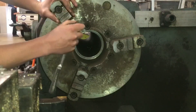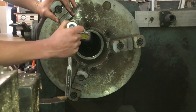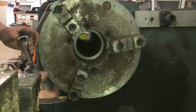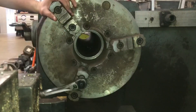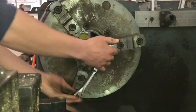I don't think they carry these Allen cap screws at your local Home Depot or Lowe's — they might, but I haven't seen them. So I'll get these both tight and evenly tighten each screw back and forth, just to make sure the jaw is seated flat against the face of the chuck. Then I can move on to the second and third one — the process will be the same.